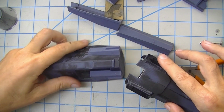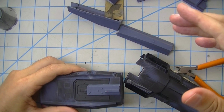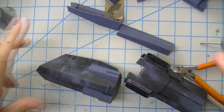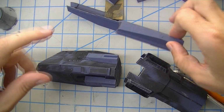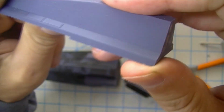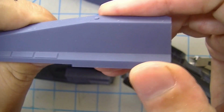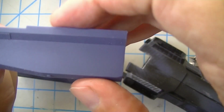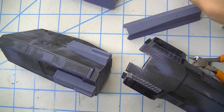And a couple of things come out in this, because there are people who talk about injection molding being replaced by 3D printing, and that is just silliness. And here's why. These are really well printed parts, but you still have surface finish issues, like I was pointing out with the seats a second ago. Okay, this piece right here looks really good. I mean, that is a nice surface finish. And it looks pretty good on all sides. So that's nice. But let's take a look, here's one.